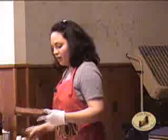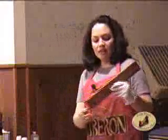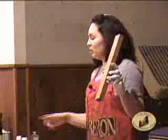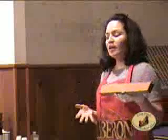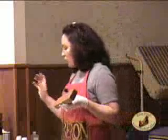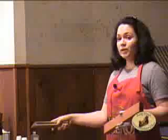So I have an example of a piece of mahogany here. This is raw, and this has one coat of finishing oil, just one, and you really need three, but we're going to apply some now, so I wanted you to just kind of see that. What this does is it warms up the mahogany and really enhances the grain, and it's just supreme. So if I had a beautiful piece of mahogany or a beautiful piece of walnut, I may not need to stain it. I can, but I may rest in the oil.